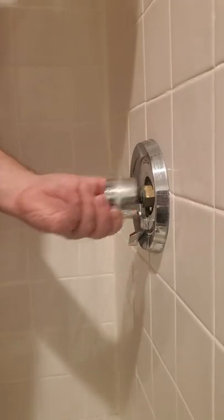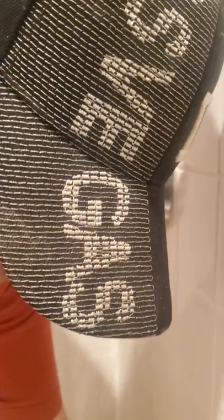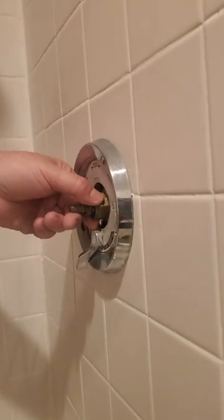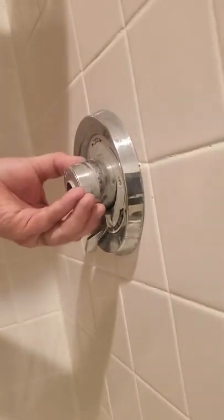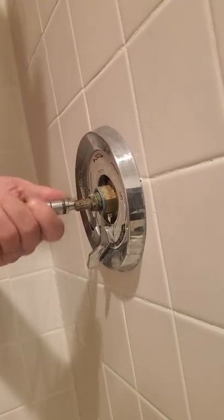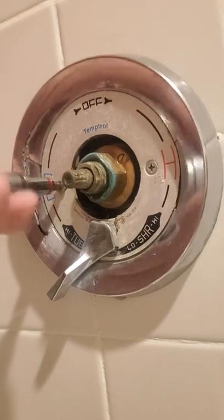Okay, so I got the cap off. That was simple — you just pop it off. You can see the little teeth inside of here that hold on, and then you get your lock set screw that goes in there. Now here's your valve, this is your stem valve going in. You saw I just removed that silver plate right here — it simply screws on, it threads on to the end of the valve. And then you just remove your two screws on the left and right side here. Remember to shut your water off before you do this.